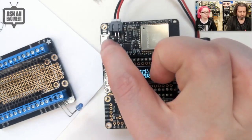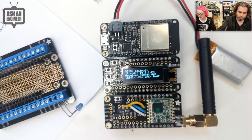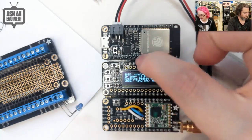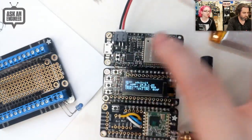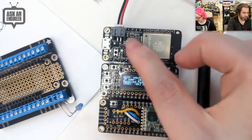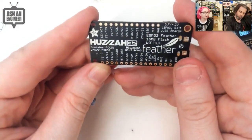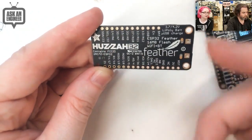I think now is a good time to release it and get it out into the world, so as Espressif continues improving and expanding the capabilities of this chip, you'll have it in hand. It comes with a USB-to-serial converter and has a bootloader already on it, so you can upload immediately. We added a reset capacitor to improve the reliability of auto-reset. It has a LiPo battery port with charging built in — up to 200 milliamps — plus a bunch of extra capacitors. All the pins are broken out, and on the bottom all the pads are labeled: DACs, ADCs, I2S, I2C, SPI.